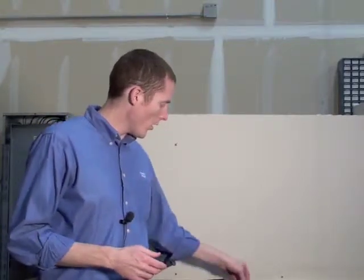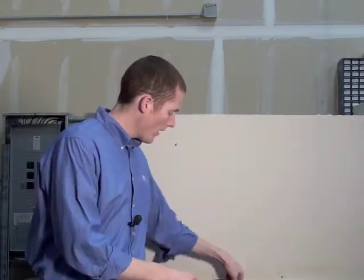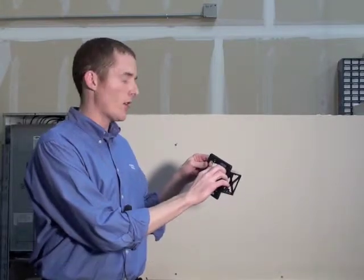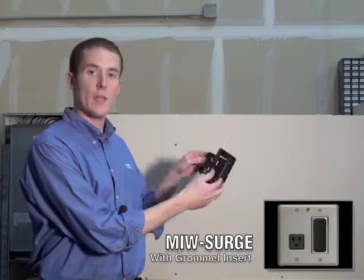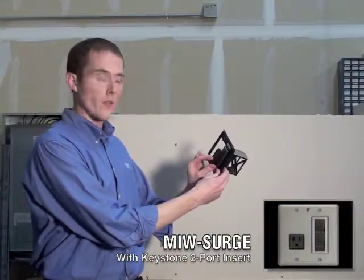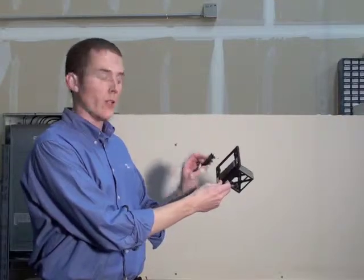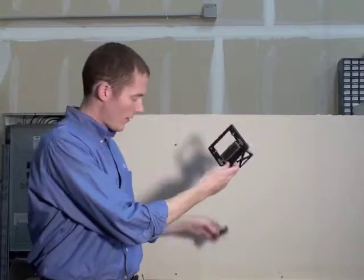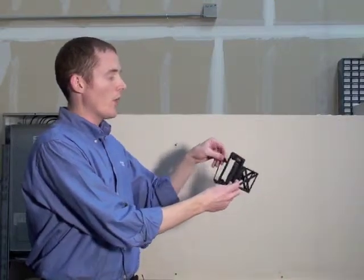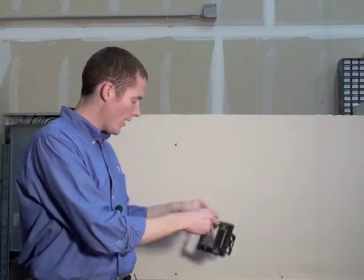I've opened my box up here and I've got all kinds of goodies. The MIW Surge itself — the XT is going to have a bit of a different chassis or housing. We have our mounting bracket here and this signal bay cage is optional depending on what low voltage adapters or connectors you wish to use. If you wish to use the grommet you can leave the signal bay cage installed as it comes out of the box. If you'd like to use our keystone ports, we include two keystone ports in the box — you can have two HDMI or an HDMI and a Balun pass-through or Cat5 right there on the face plate, and you can recess that up to an inch inside the signal bay cage. If you use the Decor adapter, which we also include with the MIW Surge and XT, the Decor ring adapter will replace the signal bay cage. The Decor adapter by itself would allow you to use a variety of Decor solutions.